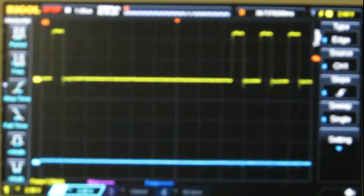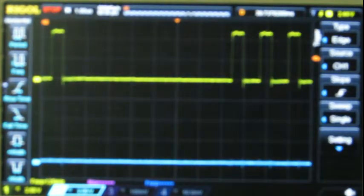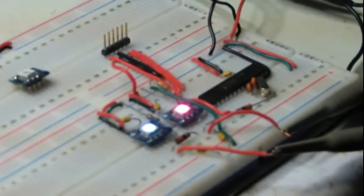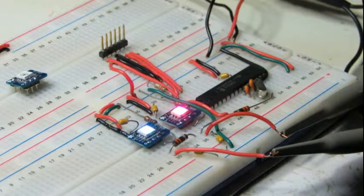And our delay is going to be about 8 microseconds. 1, 2, 3, 4, 5, 6, 7, and 7.4. About 7.4 microseconds. And the LEDs are acting weird. I need to reset mine. Maybe you'll see the red flashing a little bit. So that's not stable either. So we have to make that delay a little bit less again.